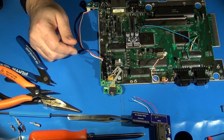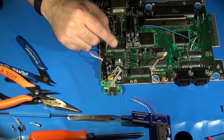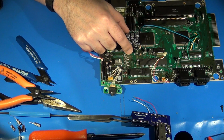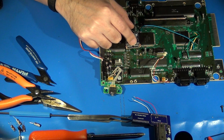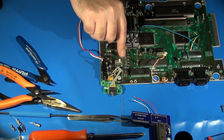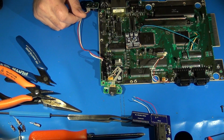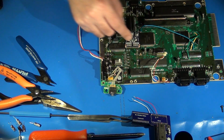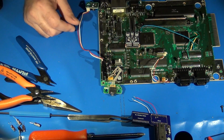Now what I'm actually ready to do is to go ahead and start doing some of the initial wiring. I'm going to wire off of the pads off of the M1 Mini Mega board first, and that's because the pitch on these pads is pretty close to each other. It's pretty small, whereas I've got a whole lot more room when I'm ready to solder those wires back down to the input lines off the PCB, off the main board. So that's what I'm going to go ahead and do now, is get some wires soldered off of these pads here off the M1 Mini Mega.